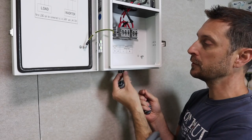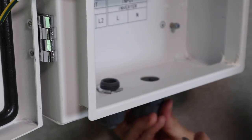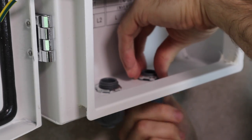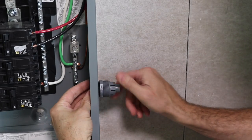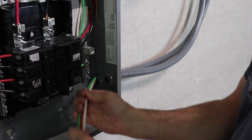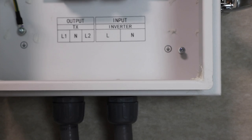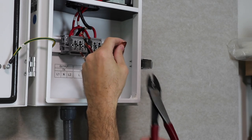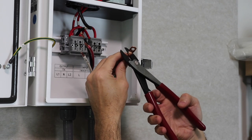I'm also going to put some flexible conduit between the auto transformer and the sub panel. To do that, you're going to need to remove the little grommets that were in the knockouts and replace them with your conduit fittings. For our ground, we're going to need a copper lug — just grab your crimping tool and a lug and get it on there.